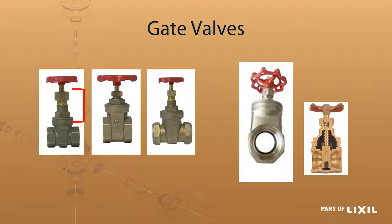The third one in the line has different ends — it's got a compression fitting on it, so that is ideally suited for working on copper piping. You'll also see that the bonnet or stem area is long, and yes, it is also a SABS compliant product.